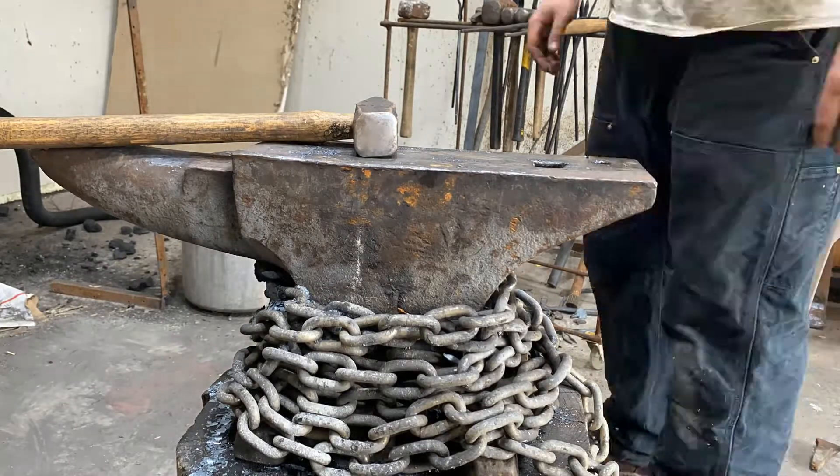I've completed the process of widening the hole to receive a handle and widening out the cheeks to make them support a handle better. I'm now going to move on to shaping the curvature of this piece and the bowl shape of the actual part of the tool that'll be doing the work — the blade, if you will. That's going to be a lot of tedious tweaking, like noticing something is a quarter inch off, heating it back up, and whacking it back into place. I just wanted to make sure you had a clear break between forming the eye and cheeks and shaping the rest of the adze.